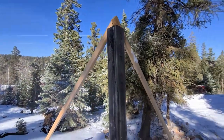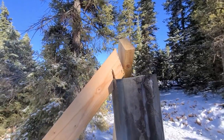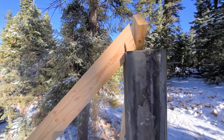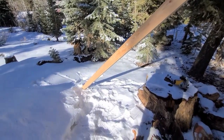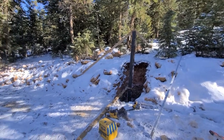We got our braces up holding the post in place. We just cut a little notch in the side of the board and let it sit right there on top — no nails or anything in it. Then we'll put a peg down at the bottom to hold it into place. Got them all braced up and they're nice and level.